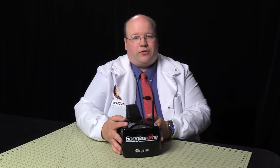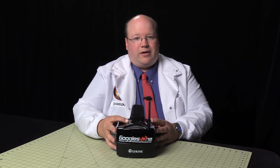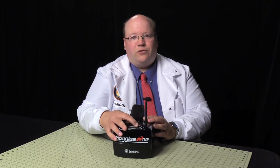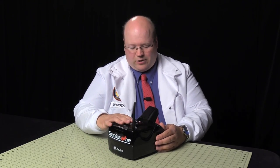As far as the hardware specs are concerned, it's got a 40-channel 5.8 gigahertz receiver that receives race band A, B, E, and F — so all your frequencies are covered. The shining star of this thing is the screen: it's a 5-inch 1920 by 1080 resolution full HD screen. I have never seen any pair of goggles with that much resolution. It's really quite amazing.